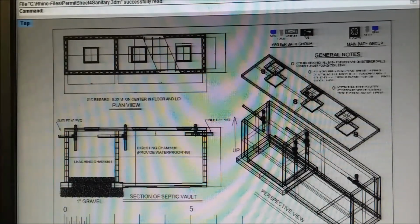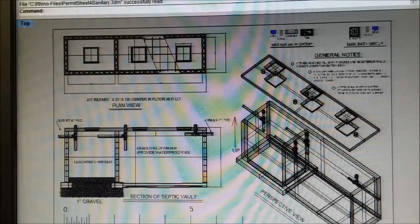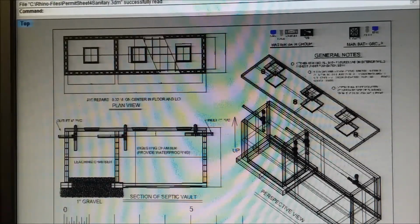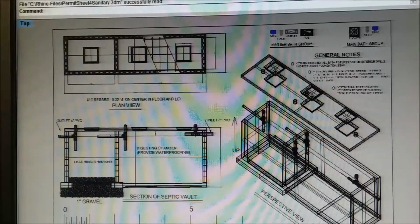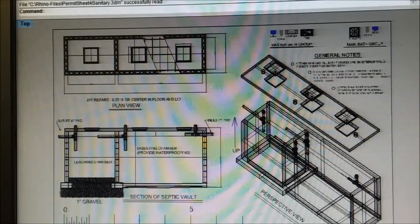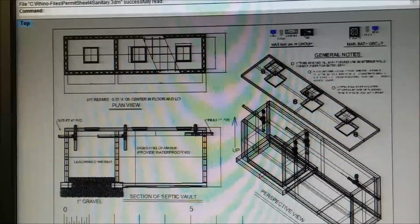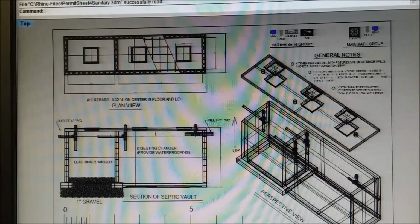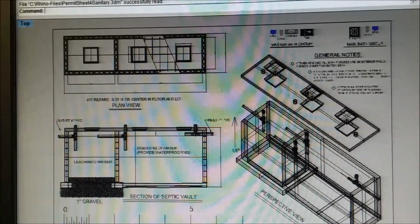If you don't operate a septic tank correctly, like if you put a lot of muriatic acid and bleach and all kinds of other stuff in there that kills the bacteria, then it quits working. But normally what you're going to find in the bottom of a working digester is sand that you get when you wash off vegetables and things in the sink. You'll find bone fragments from when they grind hamburger and stuff. You know, they always have a few bones. Sometimes they have a lot of bones, but that doesn't digest.